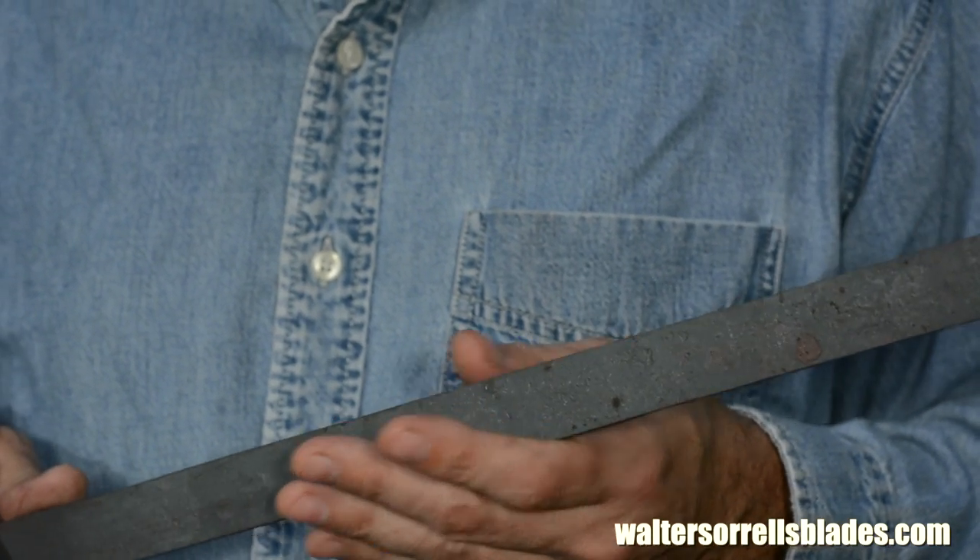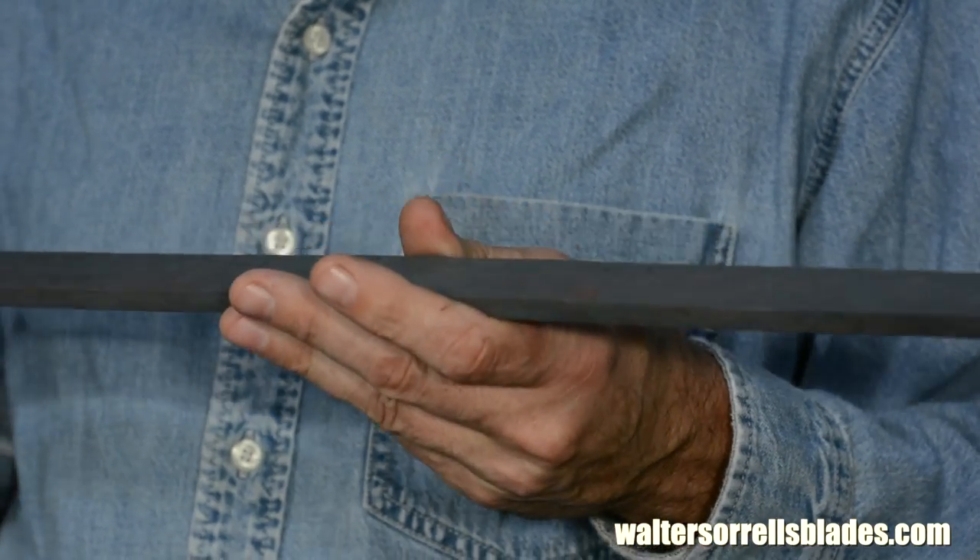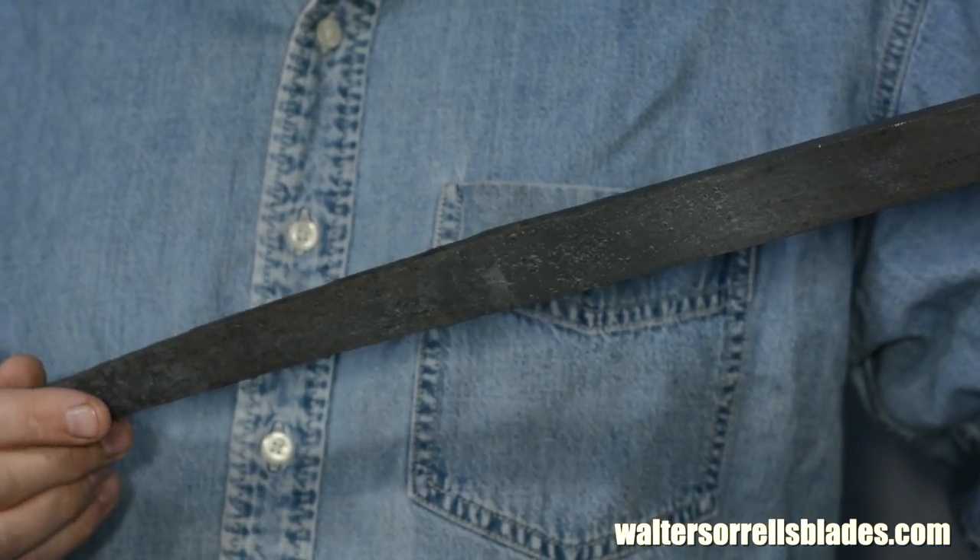Let me clarify a couple things about what I'm going to be doing here. This steel has already been forged, welded, and folded. I folded the steel into a billet, then drew that billet out and forged it into what's known as a sunobe — that's the Japanese word for a sort of preform. All of that work has already been done, so we've got folded steel in the form that's just ready for the final forging. This is kind of the fun part. All the preliminary forging is in many ways more important, but it's not as cool looking. So we're going to show you the cool part today.